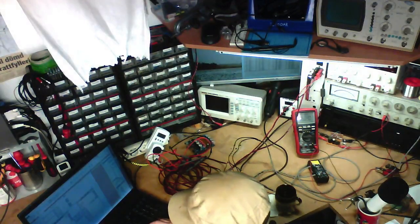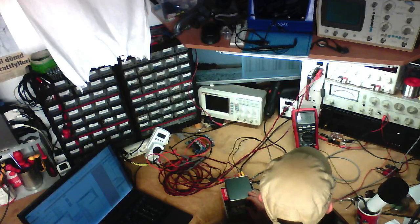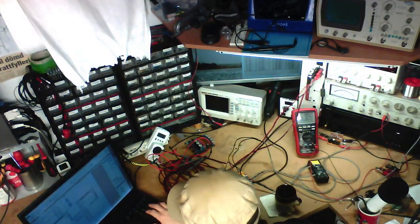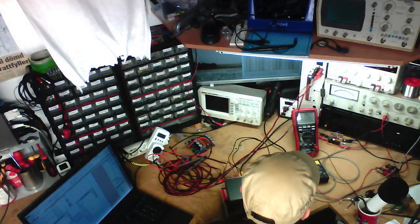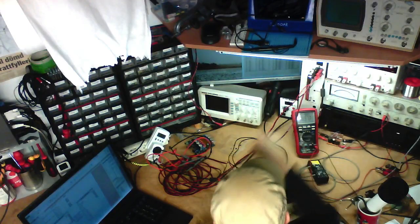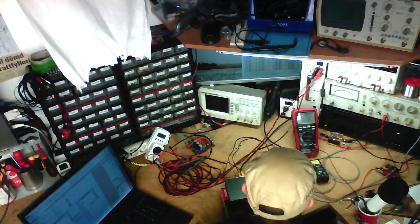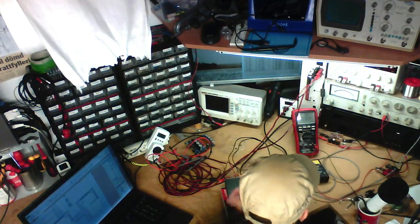No, hang on. Yeah, right channel, 6.32 volts or 5 watts. And we've got 0.048% distortion. Left channel, 10 watts, 8.94 volts. And we've got a lot of distortion. 0.14%. Right channel, 10 watts, 8.94 volts. 0.064.